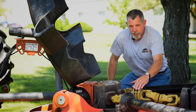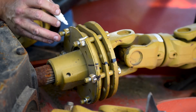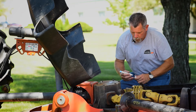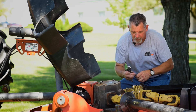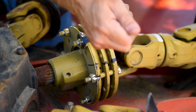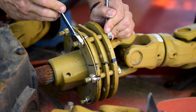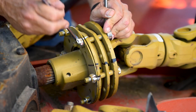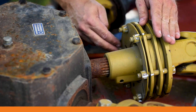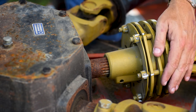The adjustment setting for a four-disc Walterscheid style clutch is three turns loose. We'll mark each nut with a white paint pen so we can count the turns — you can see this clutch was previously adjusted with a black Sharpie. Then we'll count the turns as we loosen it up. I'll hold the back bolt with one three-quarter wrench, watch the paint mark, and adjust the nut: one turn, two, and three. We'll do that adjustment for each of these retaining bolts, adjusting each equally three turns out, which creates an air gap between the Belleville spring and the drive plate.